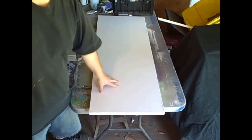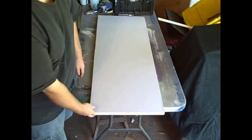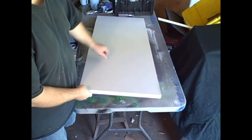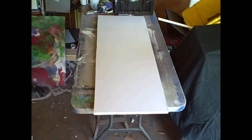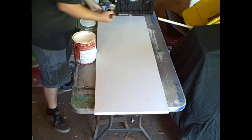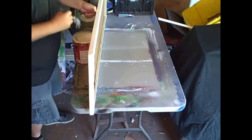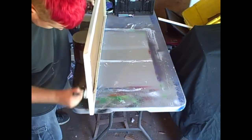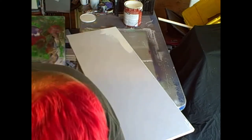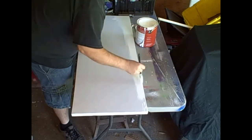We're going to paint the top of this and also the sides, and I like to paint anywhere that the material is touching - so the underside as well. You don't have to paint the underside if you don't want, but I'd definitely suggest painting at least the side edge trim. Let's get started - shake up or stir your paint to get the bubbles out. The first layer we're going to put on is actually a very thin layer. I don't do the bottom right now - it might be best to do that first, let it dry, then turn it over, because otherwise things will stick to the table.